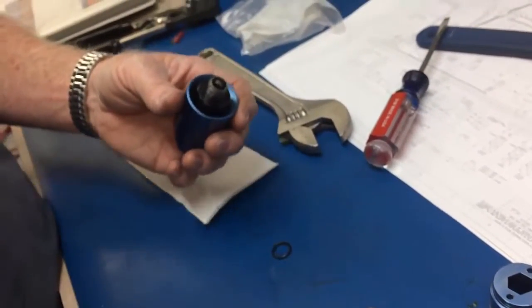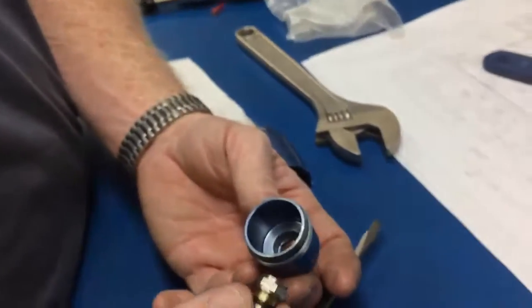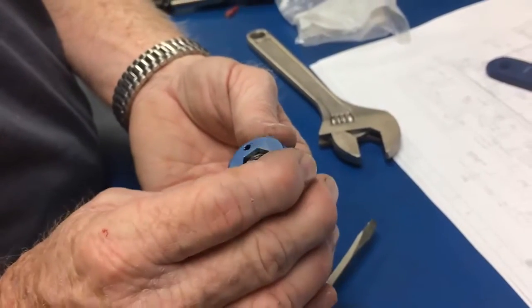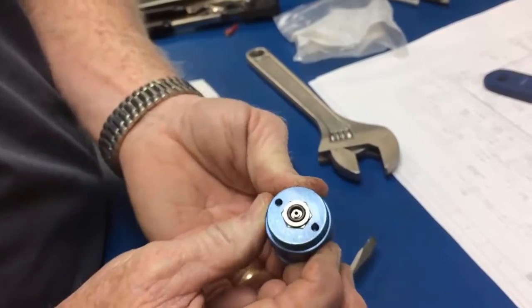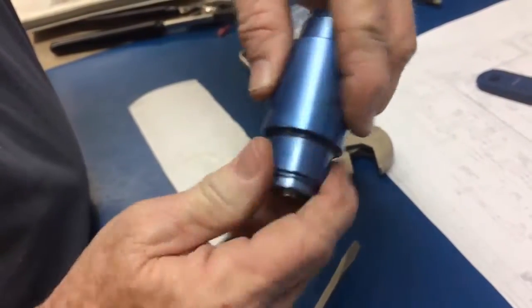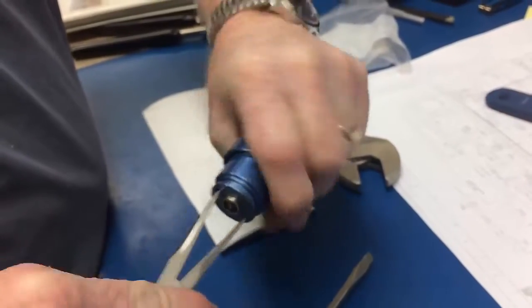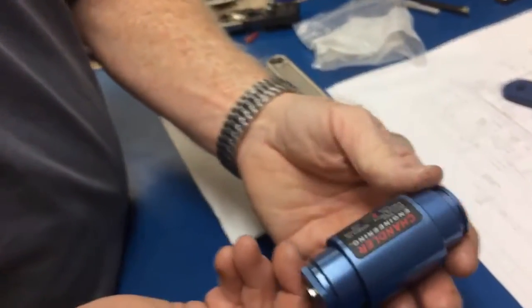Okay. Ring stop. Yep. Okay, so it's the inlet side of the valve, so you'll need to drop the piece in here first until it's snapped into place, and then screw it onto the valve body. And then everything will line up. Use your needle nose pliers and go ahead, and this is just hand tight, closing it until it won't move anymore, and there you go, it's assembled.